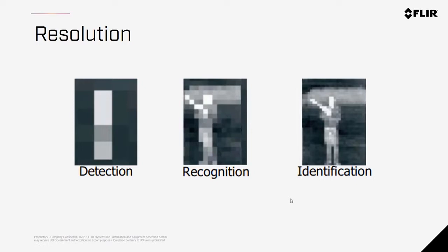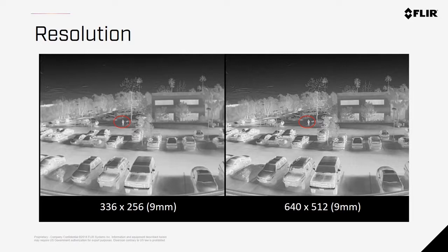These cameras do not represent XT2 imagery that I'm showing here, but just to illustrate the point. Here are side-by-side images of a 336 and 640 original Zenmuse XT. At this distance, the images are not too dissimilar, but as you fly higher, you'll see more clarity in the 640 versus the 336. If you look in the distance at the pixels between the person's legs, you could start seeing this distortion where the pixels are starting to be averaged out and they cause some blur between the legs.